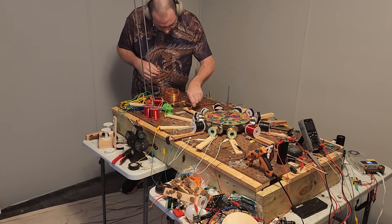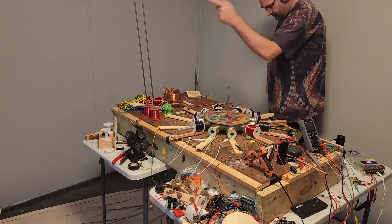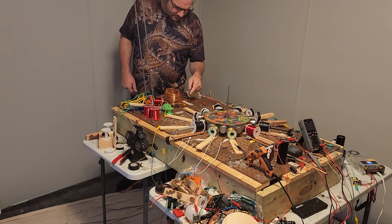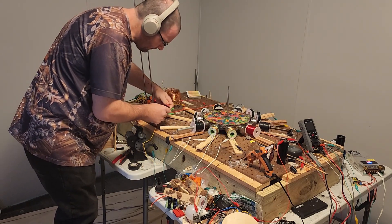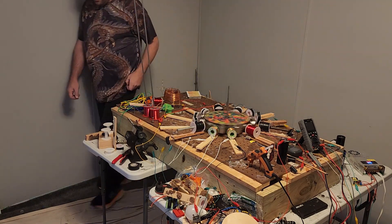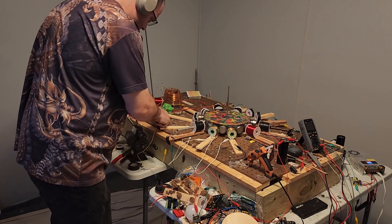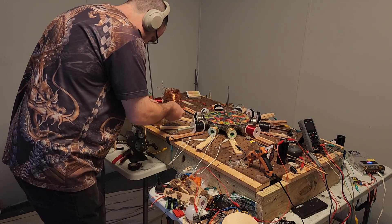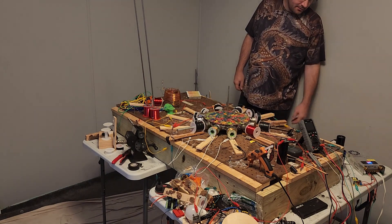What I'm doing is making sure that from the coil with the core next to the drive coil — which is the red coil — the one to the right of that, all the way around 11 coils to the one to the left of that. Every coil that I add, the voltage keeps going up — that's what's important. I was running it and it was making 14 volts, and I thought, with just 11 coils, how could I only be making 14 volts? It didn't matter whether it was DC or AC — it's all the same — because I wasn't making enough of it.